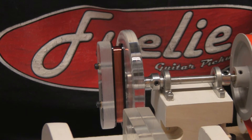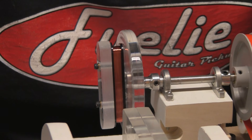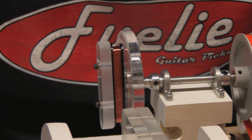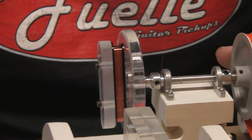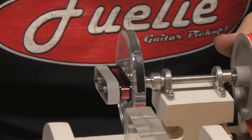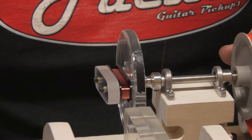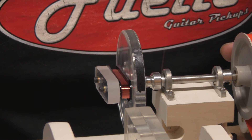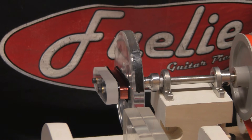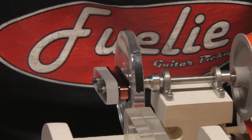It's not necessarily forcing the wire onto the bobbin. The wire is always going to follow what's laid down before the current turn, which is a bit more natural. But there's no other way around it — even on an automated traverse machine, they're still going to do the same thing. The only thing you're going to have is a dead-nuts turn-per-layer count, but you're always going to have that randomness as the wire lays down next to the previously laid wire. What I like about my traverse setup is my patterns are very linear.